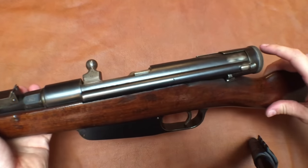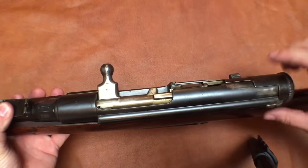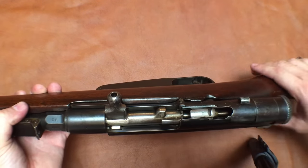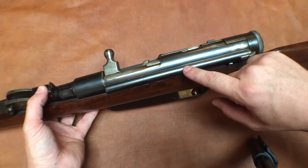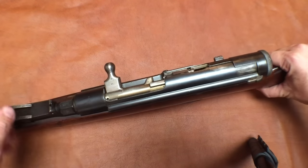They've added a big amount of metal back here — this is an added receiver cover. If we look inside here, you can see the firing pin coming back through, with an extra lug. This semi-circular bit right here encloses our return spring, which you could also call a recoil spring.